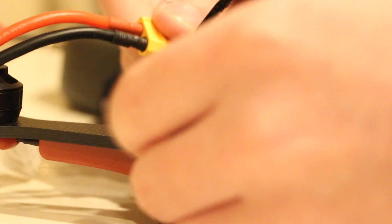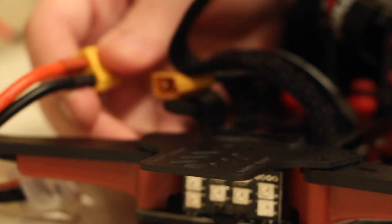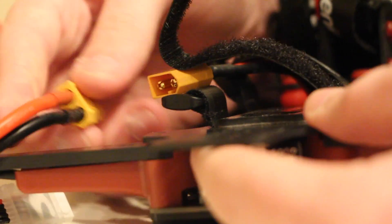Go ahead and hold the reset button on the back while you restart your drone. On the LED board in the back, in the top left corner, there's the reset button — hold that while you plug your drone back in. So it's detecting RX right now — detecting the receiver. It says 'ensure that TX is on and receiver is bound.' The receiver isn't bound yet so we're going to power cycle this again.